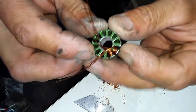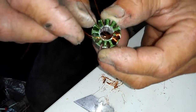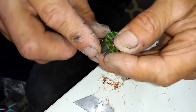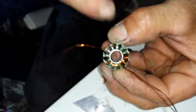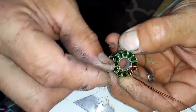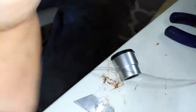So now here's where you jump over to the other side. On the last tooth that you were at, you would jump over 180 degrees to the other side. Leave enough room there for when you put it back on its mounting base with the little tabs. So on this one, when you jump to the other side — 180 degrees — you're going to come in and wind clockwise around this tooth.